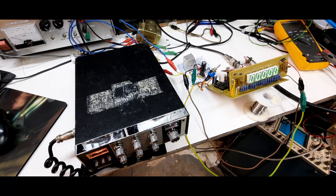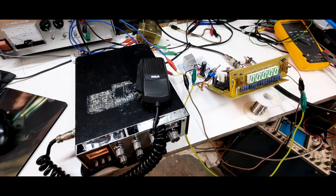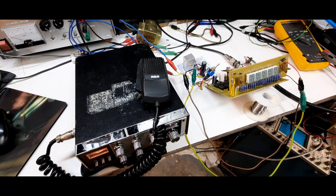We've got some good news — usually when I build a project there's always something that goes wrong. There is one small problem: I'm on channel 14 and it's reading 27.142, but it should be 27.125. So there's an adjustment that needs to be made. There is a variable capacitor at the back — I tried adjusting it both ways but nothing changed, so I need to look into that section more carefully and see if I can fine-tune it.